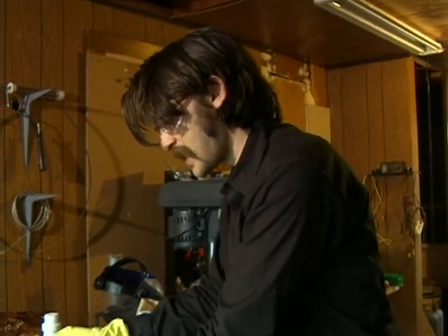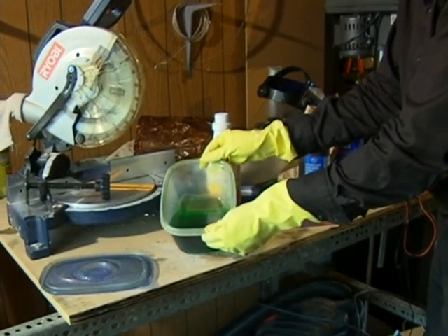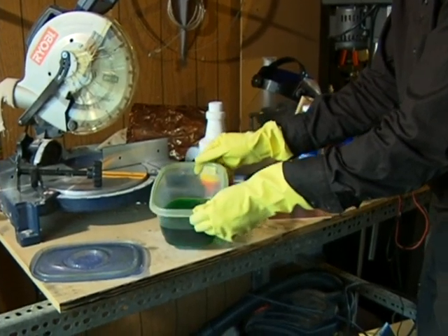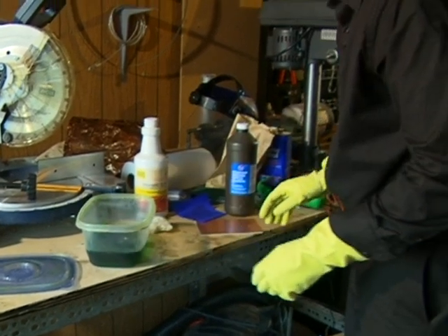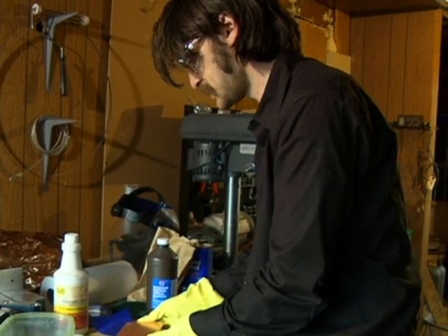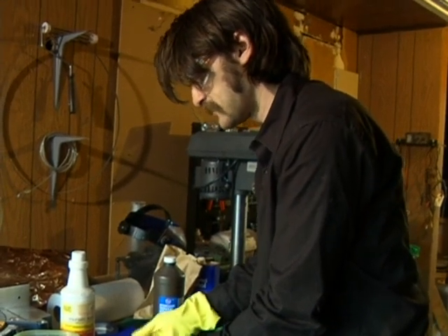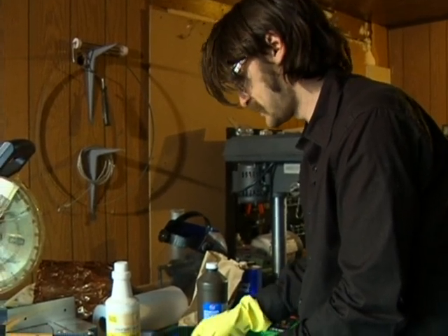After I've added some copper it turns green like this. You can keep on using the solution over and over again, just recharging it every once in a while with a little bit more of the ingredients, and it'll keep on etching for years to come. Don't be surprised — it won't turn green immediately until you've etched a couple circuit boards in there.